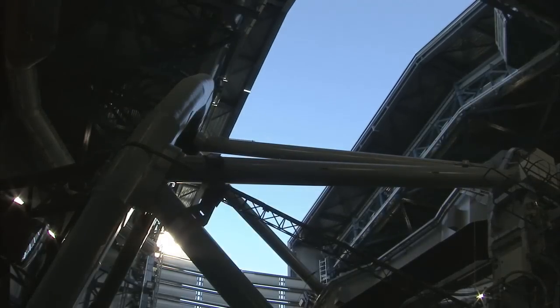Under the open sky, dust collects on the surface of the mirror. And although this layer of dust is very thin, it nevertheless degrades the quality of the astronomical observations. And so, the mirror must be cleaned regularly. In fact, it must not only be cleaned, it must be recoated, meaning that its thin layer of reflective aluminium must be replaced. The ESO technicians and engineers must work both quickly and carefully to complete this operation on the fragile 17-centimeter thick mirror in order to limit the telescope's downtime.